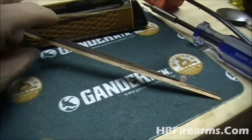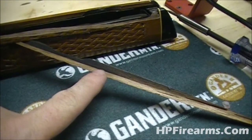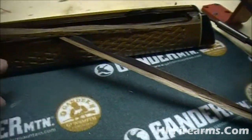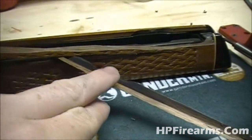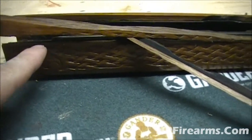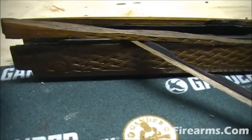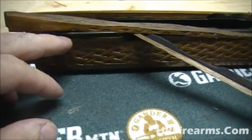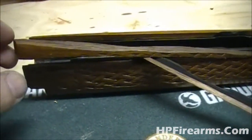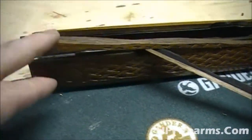It is going to take a little bit of our finish off, but that's okay — we'll put it back on. Basically what this is going to do is draw out a lot of those oils and resins and open the pores up. So basically, this was the broken piece — I'm just using it to prop this other piece up right now. This is the original reason why it came in for repair. But underlying where that piece broke off, there was another crack that ran right down through here. It was a previous repair and it was done poorly.